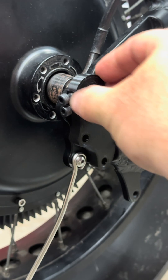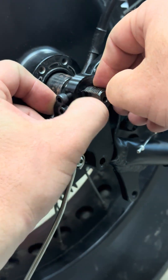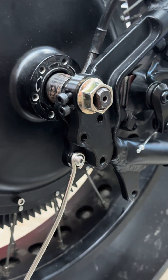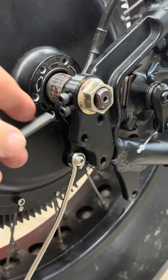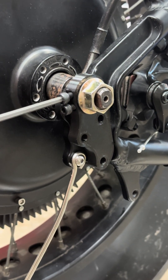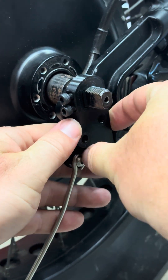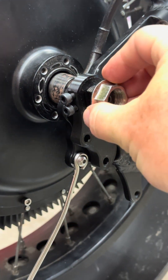This goes on like so, and then this little plate slides in the side like that. Then I put the nut on just lightly to hold it all aligned, and then you come in with this and tighten these down — as you do that, you're clamping the internal plate down across the flats of the axle, giving you zero wiggle room. I can demonstrate that even with this plastic printed version: wiggling it back and forth, you can see it actually moves the axle and the motor together. When these are made out of actual metal, this is going to be very solid.